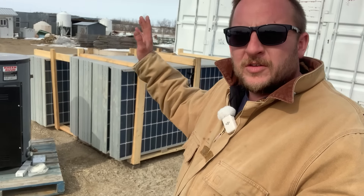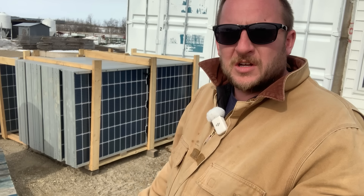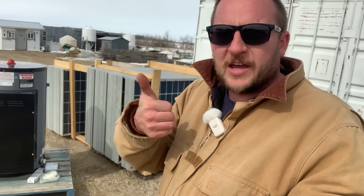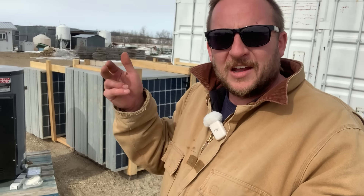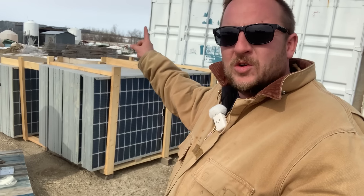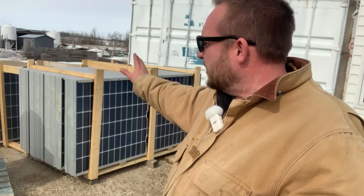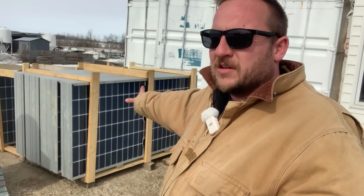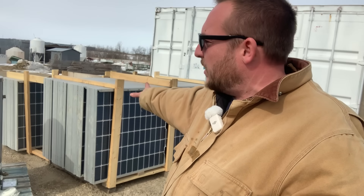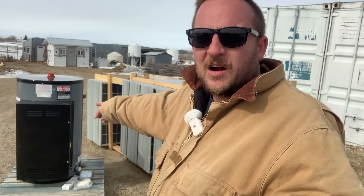Water is my battery. The cheapest part of a solar panel system is the solar panels. The expensive parts are racking, charge controllers, inverters, and batteries for electricity storage. When you wire nine panels together, that equals 4,050 watts — a string of nine panels into each one of the 4,000 watt elements in the water heater.